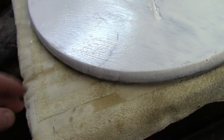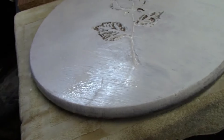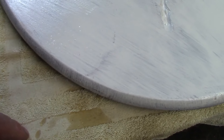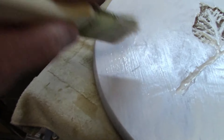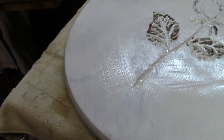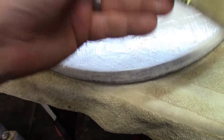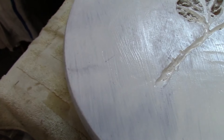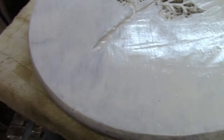It's drying quicker than expected because it went into fresh wood. Now there's what's called a step - I don't know if you can see that. The way you get a step is if you're painting and you start in the middle, you're going to get a ridge where you put the brush. You always want to start on an end that isn't painted yet and brush into your paint.